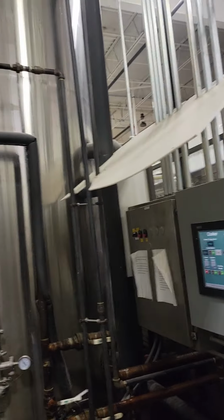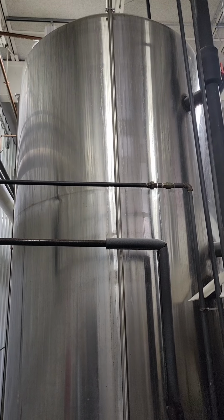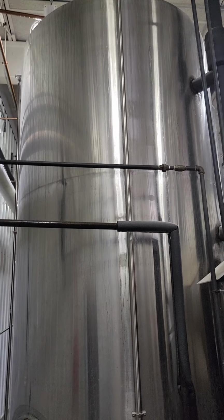Part of that problem is related to the fact that it has been incredibly hot here in southern Indiana for June. One of the master heads on our chiller outside actually went down, so we're operating the chiller on about half power. Now the problem with that is that chiller is our entire cooling source, short of this tank, which is a 2,000 gallon cold water tank, which is jacketed.